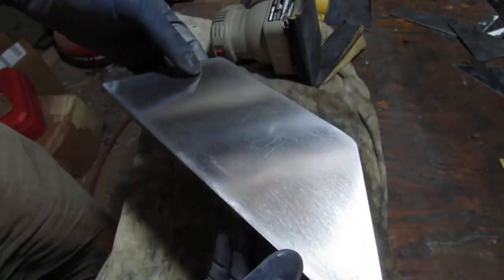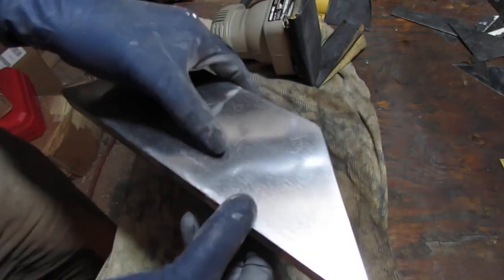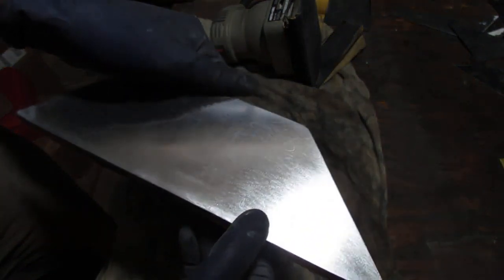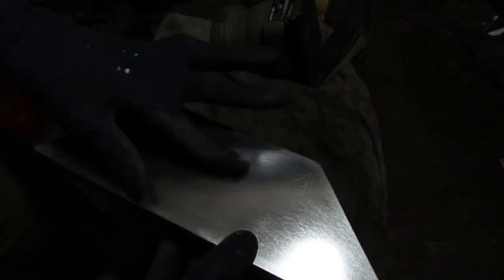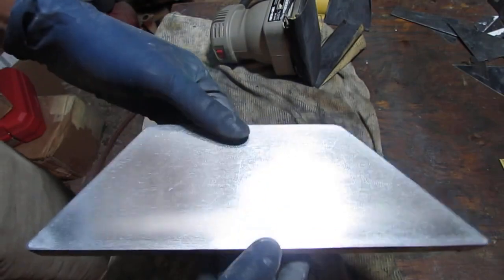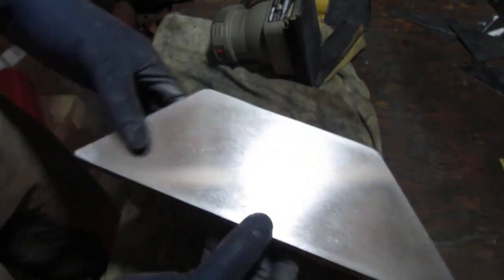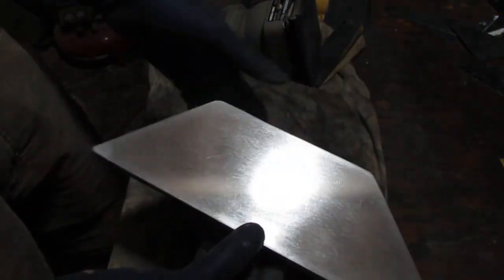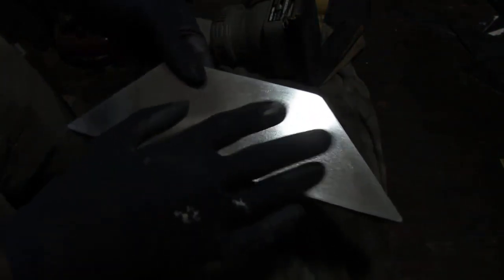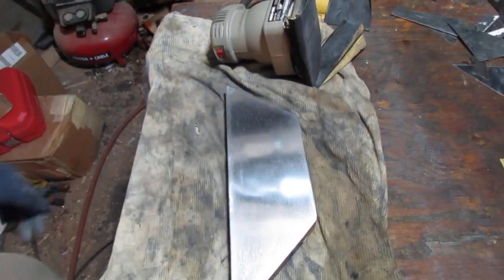They're deep enough that 600 grit is just not going to cut it. So probably like 200. Okay, whatever. I'm agonizing over a POC. It did make a nice texture though. I like this. If I want to get a certain kind of look, I haven't thought about this. Alright, moving on. I'm going to go back, finish this off, go back up to like 1200, and then buff it down, see what we get out of that.